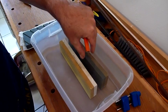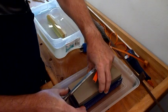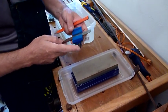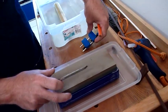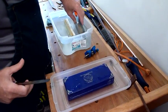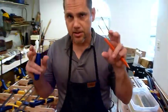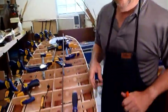And when I sharpen them, I'm not going to do it, but the Norton stones come with this nice little thing here. And I put them into a jig so that you keep the same angle when you sharpen them. And the key is get them really sharp. If you don't have the money for whetstones like this, Google Scary Sharp and use that method. It's where they use wet sandpaper.